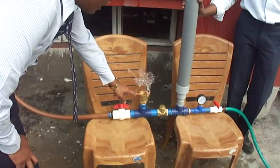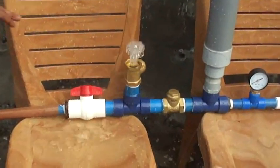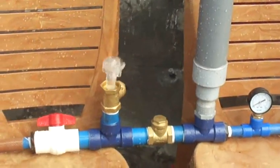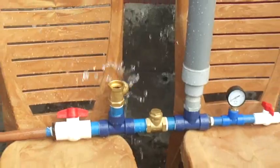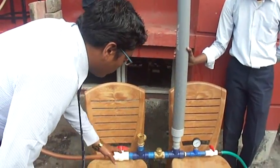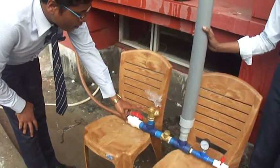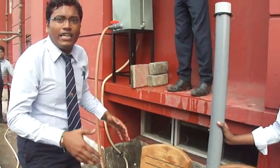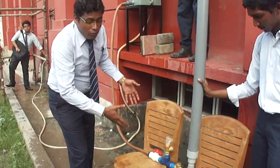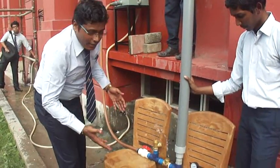You can see the water coming out through the waste valve, and from the sound you can really understand what is happening. When the water comes through, there is kinetic energy within it. As there is a pressure build-up, it gets converted — it stops — and for that reason the kinetic energy within the water is transformed into pressure energy.